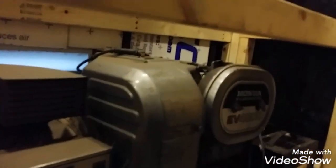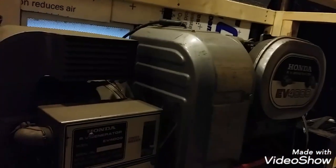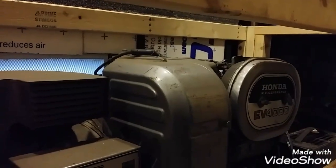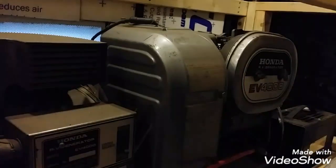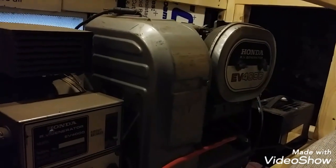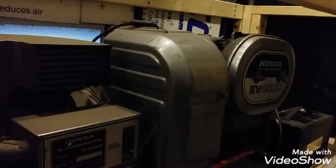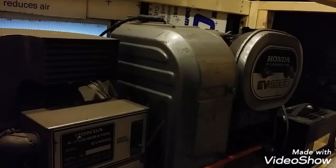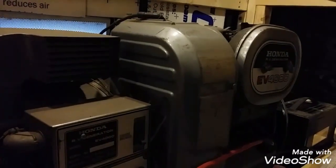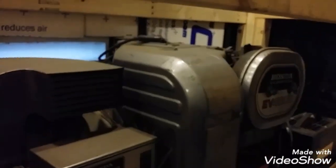It is time to get the onboard generator up and functional. It has been mounted, and the exhaust has been run for some time. Last video we put the fuel tank in for it by taking the original truck fuel tank out, because the truck was converted to run on propane, but this generator runs on gasoline. So we swapped out the probably 30-gallon gasoline tank for a 17.5-gallon marine tank. It took most of the day last Sunday, but we got her done.